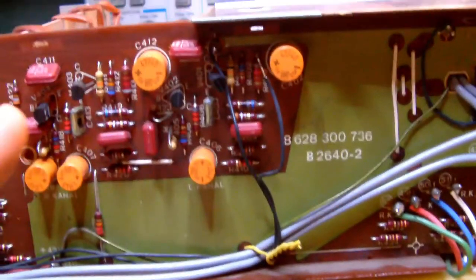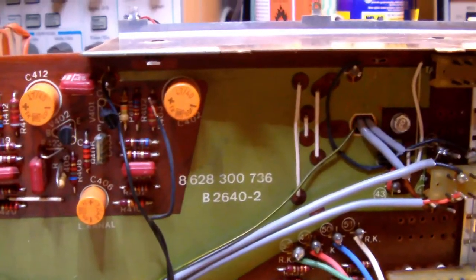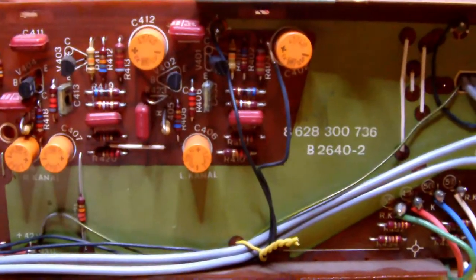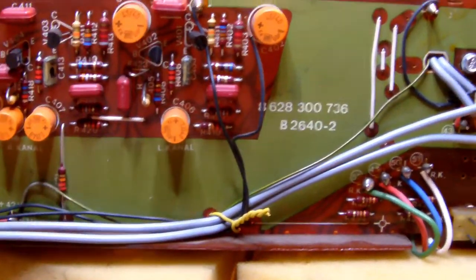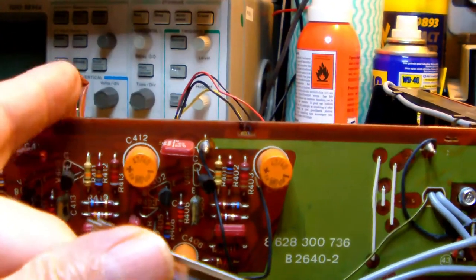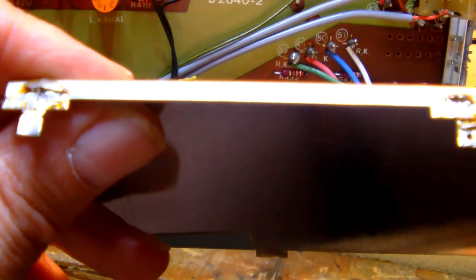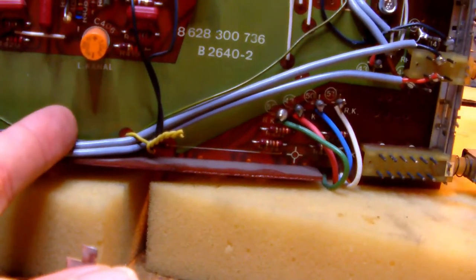It turns out that to be able to reach the PCB side to unmount the electrolytics is actually easier than I thought it would be. You'll remember that at the back of the pickup module there was this metal covering. In essence, what it boils down to, to be able to reach the copper trace side of the PCB, is you just need to unsolder 3 points at the top of this metal cover, and uncrimp 2 of these tabs at the bottom of the print board.